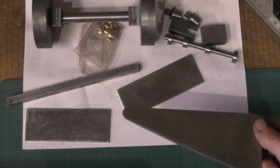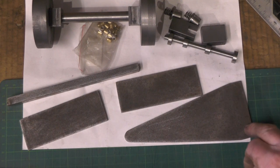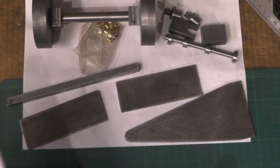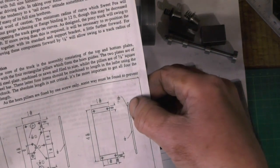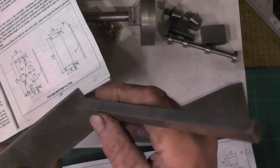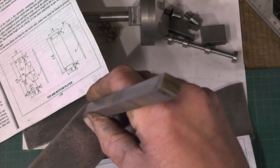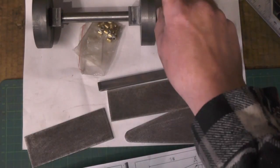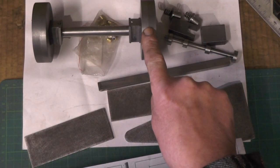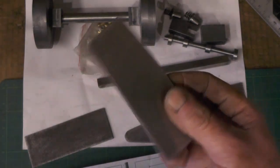Okay, that's my cardiovascular work finished for today. So I've now got to drill the holes in each plate, and on the bottom plate I've got to mill a 1/32nd step on each end. What that's for is, once the horn pillars are fastened with that one hole underneath, it's to stop them being able to twist. And then all the relevant holes in the top plate. So I'm going to either head over to the lathe to do my tread on my wheels, or head over to the miller to do the step on the bottom plate.